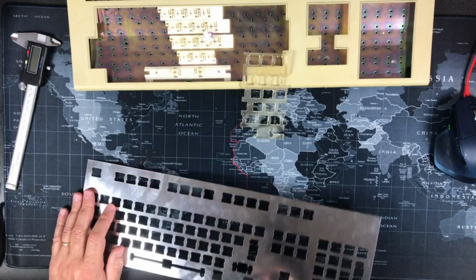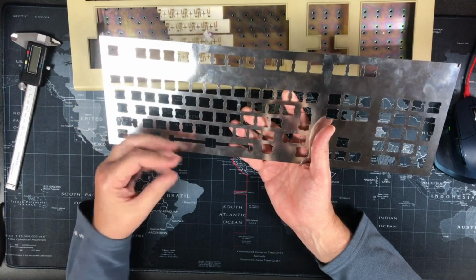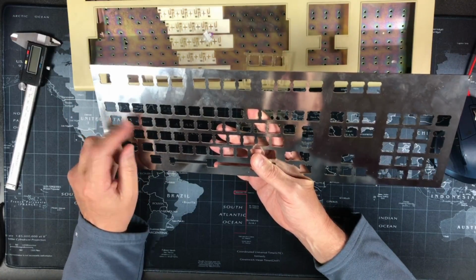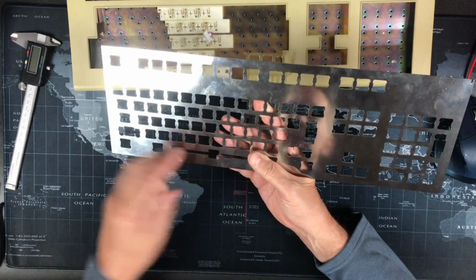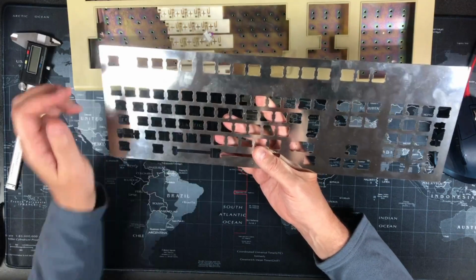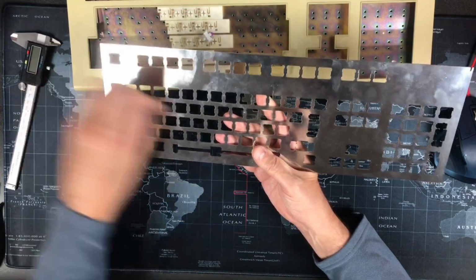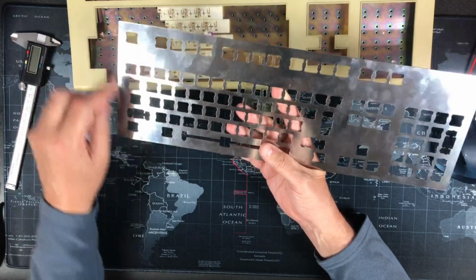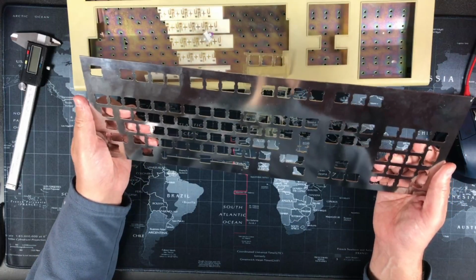But let me tell you, I have some more crazy ideas. Like that Swill KB that you saw, he just took the keyboard layout and transformed it into what that would be to machine a plate. But in Fusion 360, I just watched a video from the guy about patterning. Basically I can take this pattern and replicate it across all the dimensions. So you can fairly easily do your own layout in Fusion 360. If I have the shape of this cutout, I can tell it how to repeat and how to stagger the next row and repeat. So probably I'll make an alpha layout that's close, and then maybe copy and paste the remaining few, and you can imagine each row having its own layout already laid out to start, and then maybe move stuff from there.